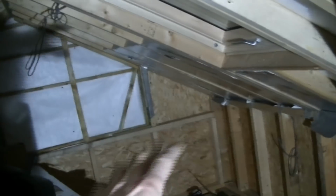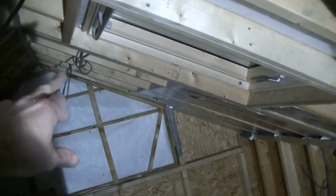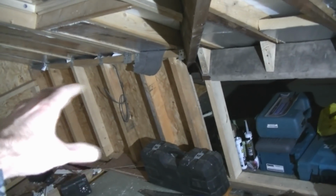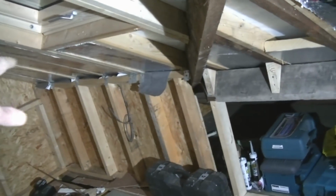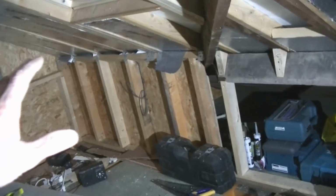Down there you've got to imagine there's going to be a wall down here. So this side there will probably have a desk down there, something like that. So again, we've got 2 lights up at head height there to go down onto the floor. And then what I've done is taken a cable down to the stud wall there. So I'm probably going to have some sort of uplighter off the wall down there that'll just cast some light onto the ceiling. I didn't really want any downlighters too low down because it just seems a bit pointless.